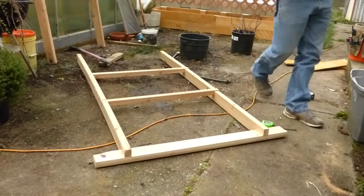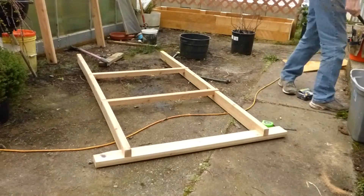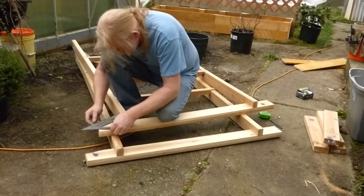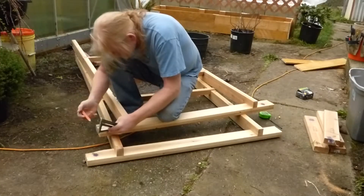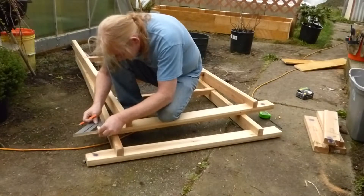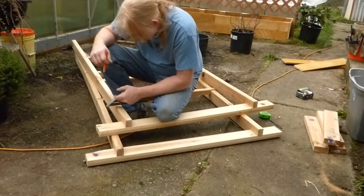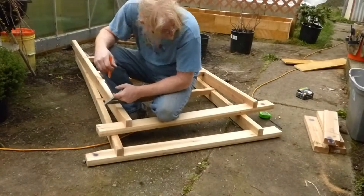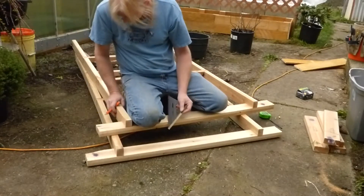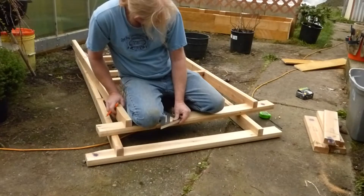Okay, so the last thing we need to do is attach the two sides. I'm notching to receive the boards that are going to cross the walk area and attach the two sides. I'm notching them because the nails are a little bit shorter for 2x4 construction than I would prefer. And of course that always helps the joints. And pretty.